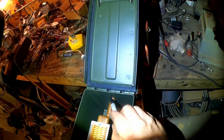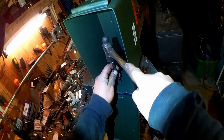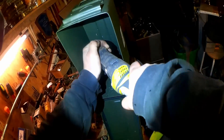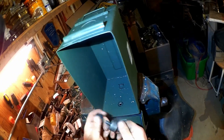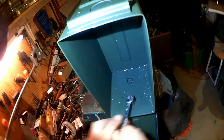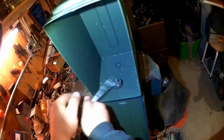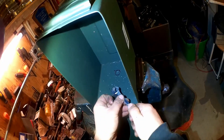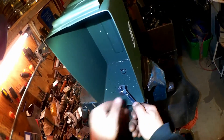I'll just mark some holes here, then center punch those, and drill them out in two stages so they're the appropriate size to use the electrical punch. And sure, at this point you might say: why don't you turn that box over and make wrenching that punch a thousand times easier? But let's not forget the original guidelines for the project — as little thought as possible.